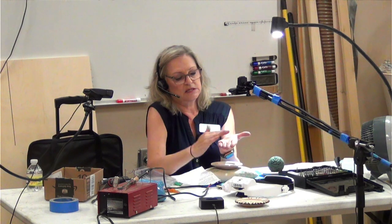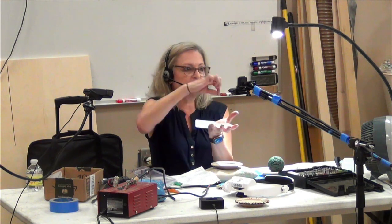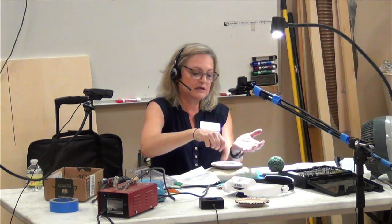You have to be careful with the NSKs because you can burn up the turbos really easily. So like if it starts screeching like you're in a dental chair, you need to pull back and do it little at a time. Like we even made a thing that shows your depth gauge, 1/32nd, 1/16th, and you put it in there to get your depth. And like if you carve it out, then you can go another little deeper and a little deeper. You never want to go full depth.